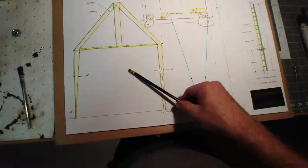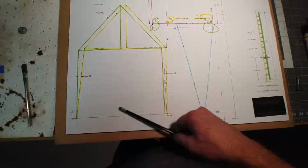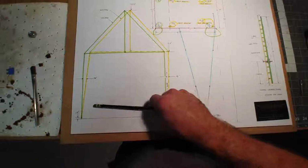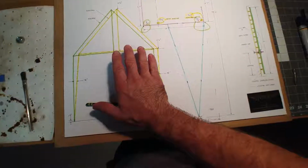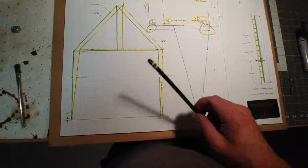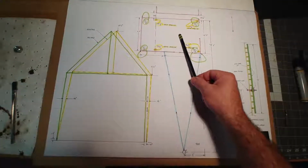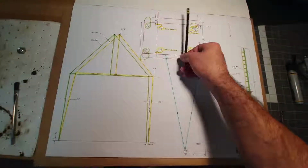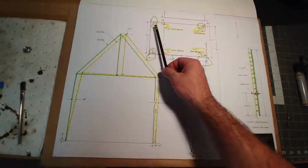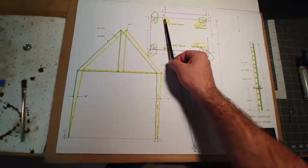Originally, I thought that opening up a garage door and having matched lumber sheathing only on one face of the barn to boot had created a weakness that had over time allowed the front to shift. It certainly hasn't helped whatsoever. However, I did set up a laser transit inside the building here, so I had a laser line going all the way around, and I went to these four green X locations, yellow X locations.